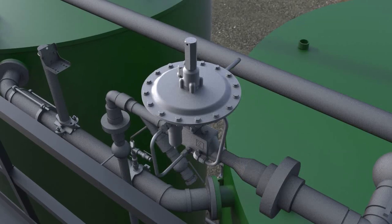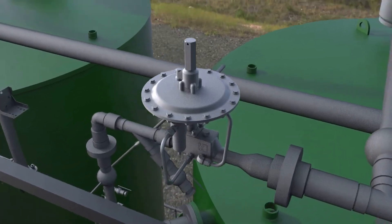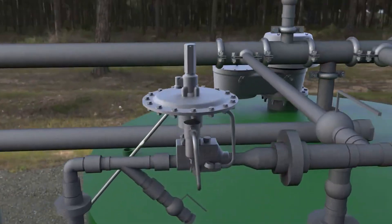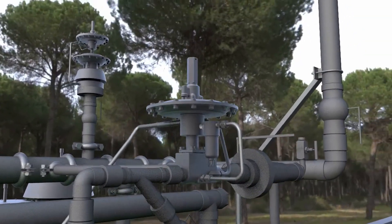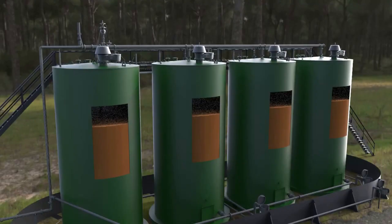How does it work? The Sense Line loads tank pressure underneath the 1078's diaphragm, allowing precise detection of pressure changes within the tank. During a pump out situation or thermal cooling, the pressure inside of the tank decreases.